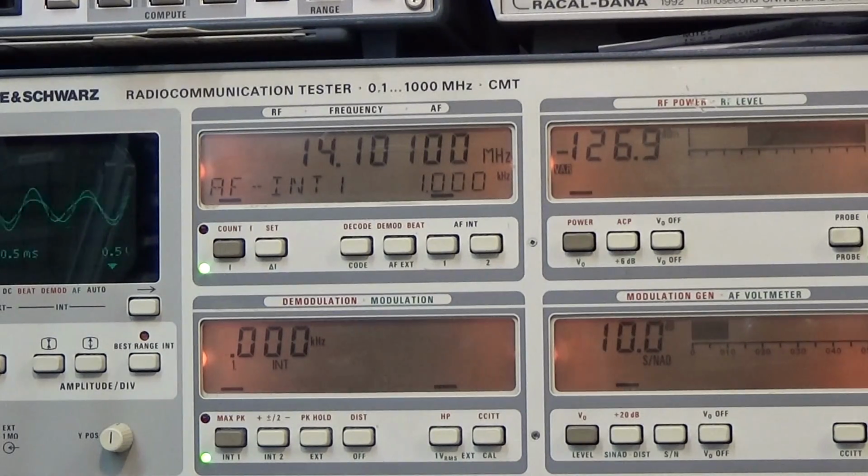So, and to summarize, the radio is back to a nice frequency setting. So the radio is within 1 or 2 or maximum 3 hertz, depending on the crystal temperature inside. And I've measured the radio cold, when it is absolutely cold, and under this condition there is only a frequency offset of 13 hertz, and that is excellent. And if it is at operating temperature, we have approximately 1 to 3 hertz off, so that is great.